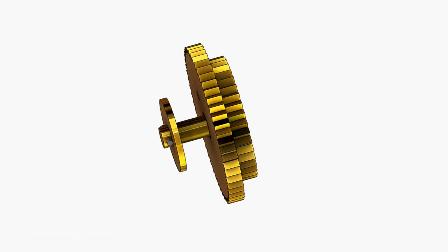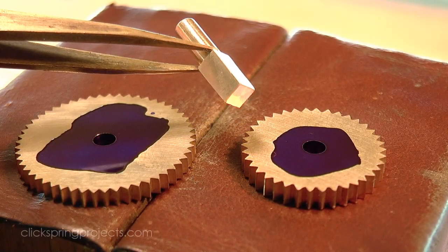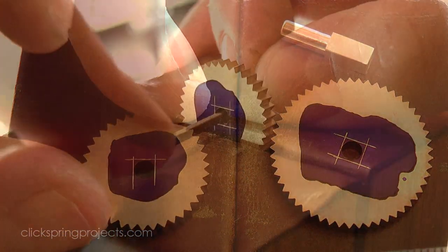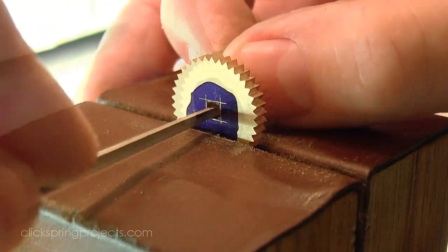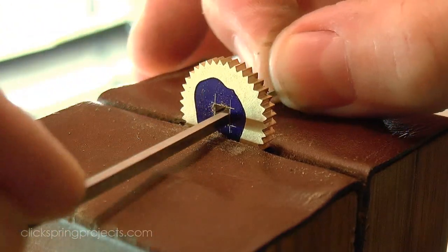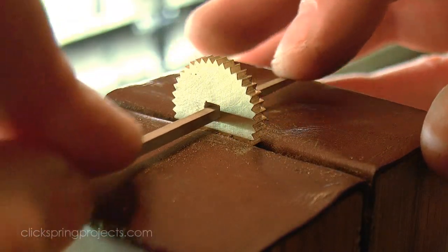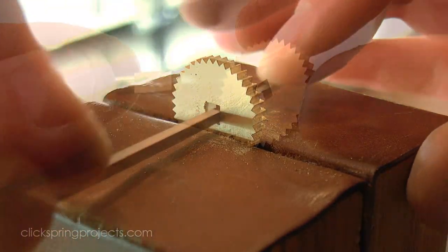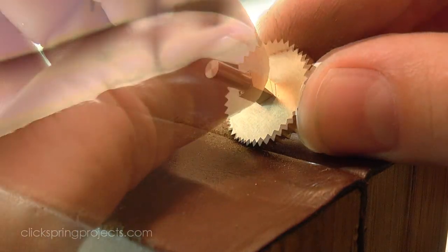Next up, I made the wheel assemblies, which follow a basic pattern of square holes threaded over square shafts. Each of the assemblies presents different combinations of tapered arbors, interference fits, as well as rivets and pins, as fastening techniques to keep the wheels in place on their respective arbors. But the way that these ideas have been executed in each case says a great deal about not only the state of the engineering technology of the day, but also the objectives of the maker when constructing the device. And the L assembly is a great example to show you what I mean.